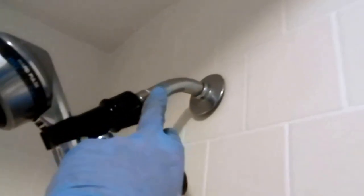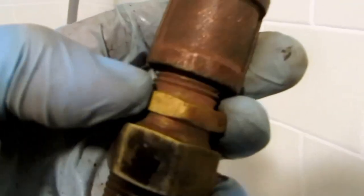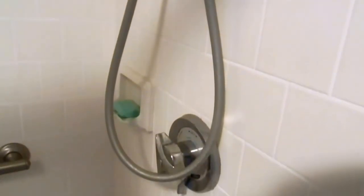What I'm going to do on this system is take the shower head assembly off. I got this adapter here — it's basically a brass coupling with a thread-by-hose adapter, and I can plug that right in. I can take it off for different applications if I want. This goes onto a hose, and for me this is going to work out great because I have to put pressure on the hot water side to get rid of the water in the water heater first. I'll be able to mix it either hot or cold through this valve putting pressure into the system.